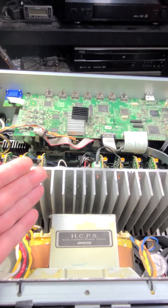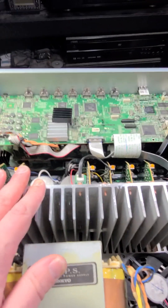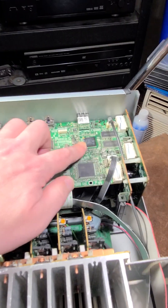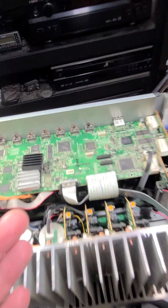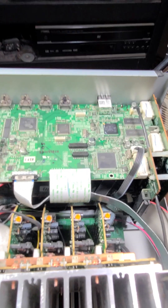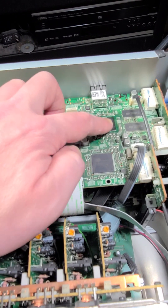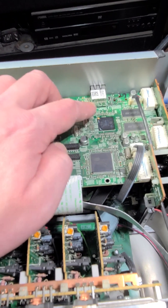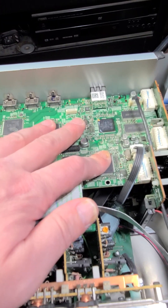Kat, it's Maximus here. One of my more successful videos was the HDMI board DTS chip repair, where you heat up the DTS chip to fix issues where the surround speakers aren't working or the speaker grid isn't displaying. It worked for a few months, but it continues to go downhill. The nature of the problem is that the internal microwires inside the black chip package itself are what's failing, not the solder joints between the package and the circuit board.